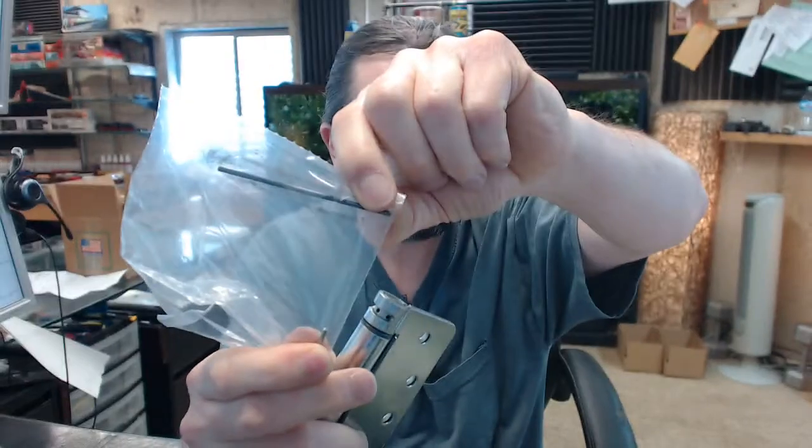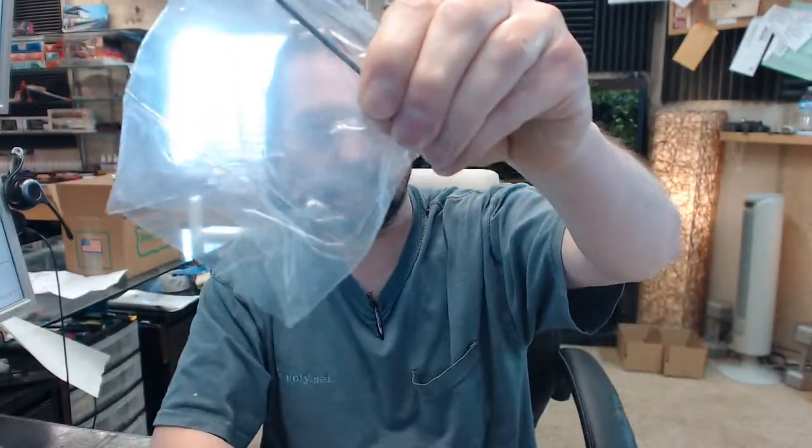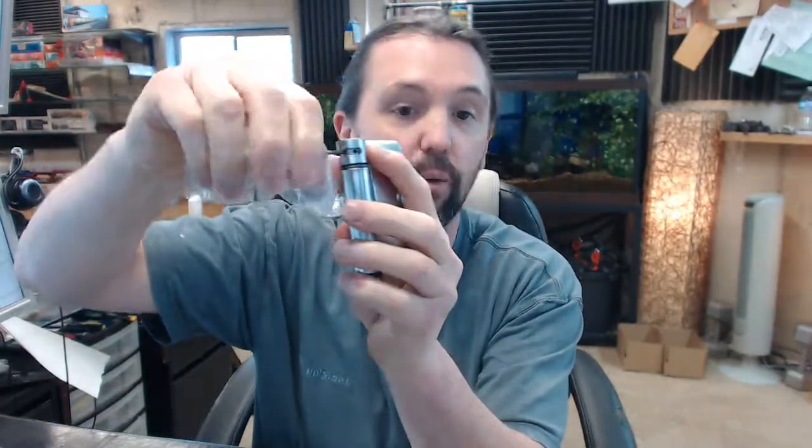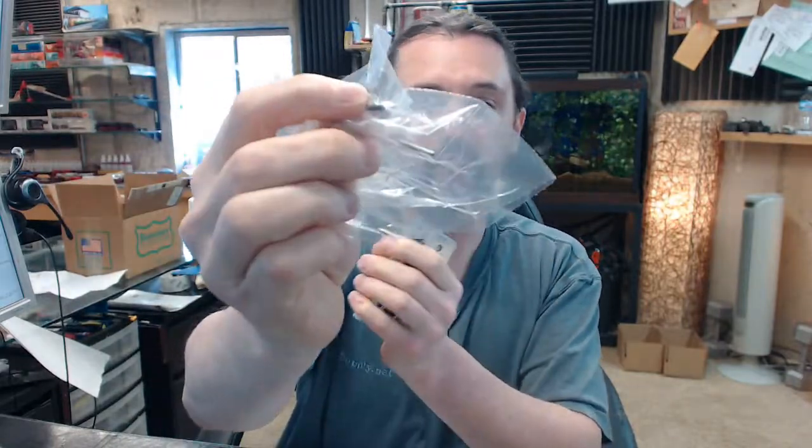That you will set the tension by use of the included tension rod, black piece of steel, and then the tension pin. It's there, that piece of silver steel. I'll poke the tension rod out just a little bit from the edge to demonstrate. You will want to insert the tension rod into one of the holes and turn the tension collar clockwise. And as you do that, it reveals new additional holes. Into one of those new additional holes, you insert one of the tension pins. Okay, that silver pin. No more than 3 holes is what's recommended. And that will allow you to set tension on the spring hinge.